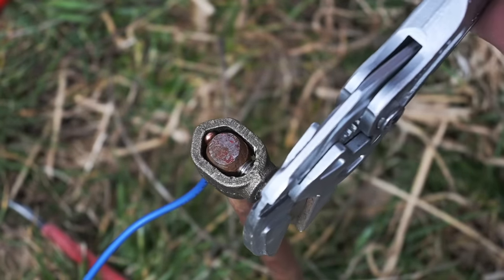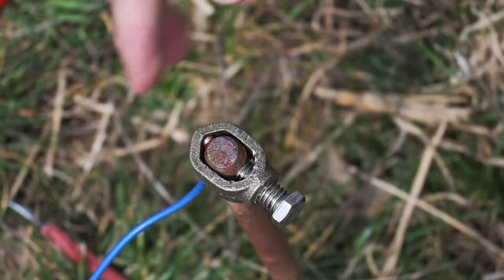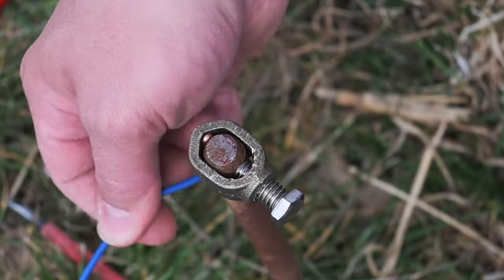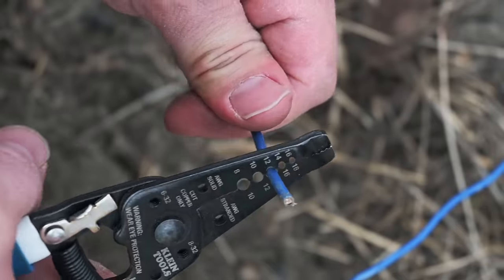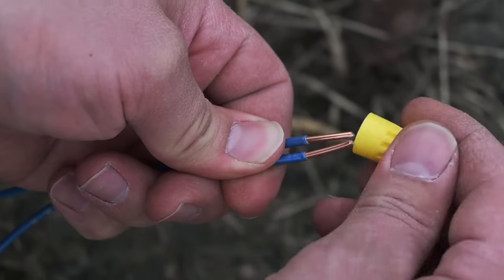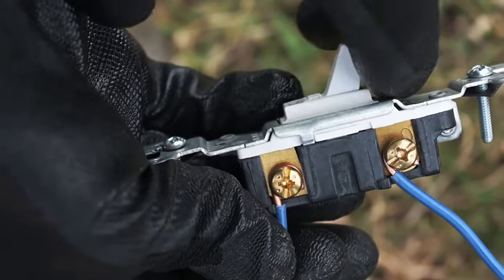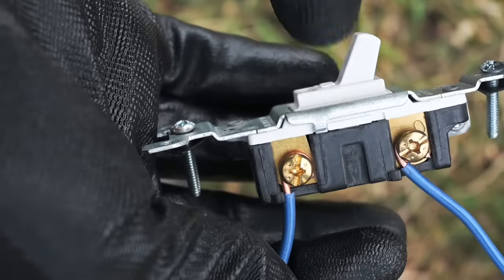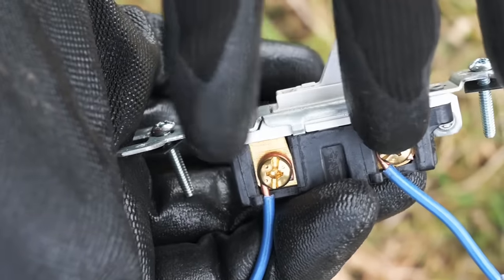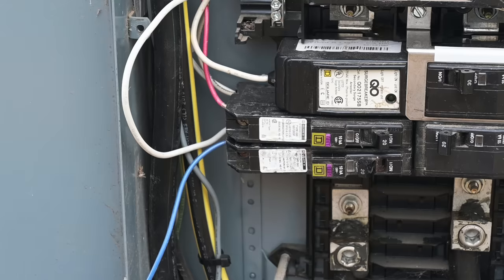We'll start over here on the ground rod. You can see we've got this acorn clamp — a grounding clamp — and we're going to get that nice and tight onto our 12 gauge wire. Normally this would be a larger conductor, typically like a 6 gauge, but 12 gauge is adequate for the test we're doing today. We're using scrap wire and extending it with a standard wire nut. In the middle of our wire coming from that ground rod, I've put a single pole switch that we're going to sacrifice — it may be a little hard on the contacts, but it will serve the purpose for connecting and disconnecting our ground rod from the circuit. I tested the switch to make sure the contacts are good and we're getting zero ohms through it when closed. Right here in the panel, we have a 20 amp single pole breaker connected to that same blue wire hooked to the switch and the ground rod.